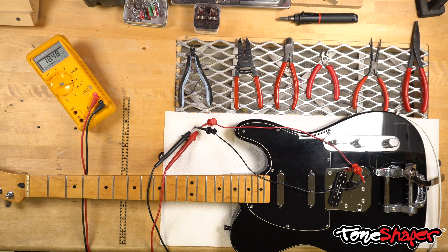Now we perform the test like we did on the Fender pickups, and we want it to give us the same result — which was to raise the reading before it settles back. I'll touch the screwdriver to the top of the pickup, let it stabilize, and pull it away. The behavior is the opposite of what we had before — the Duncan pickup drops where the Fender pickups raised. So if we wire the Duncan per Duncan's suggested color code, the Duncan is going to be out of phase with the Fender pickups, and the two position where we're combining the bridge and middle will sound thin and weak.